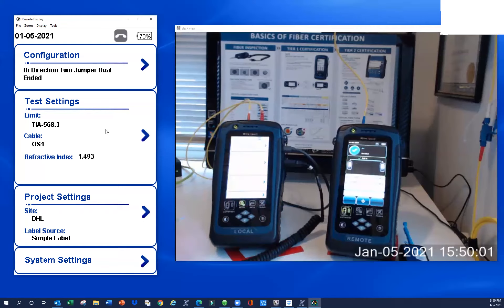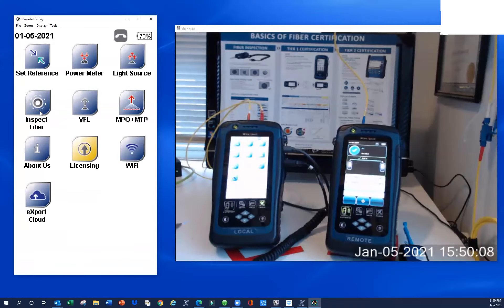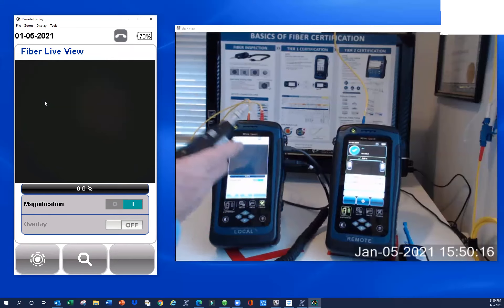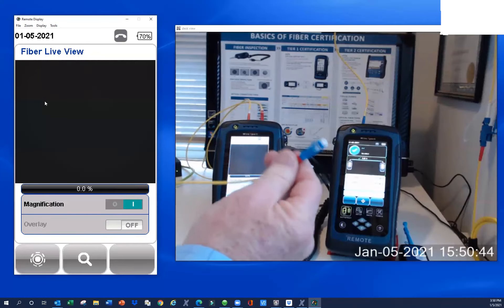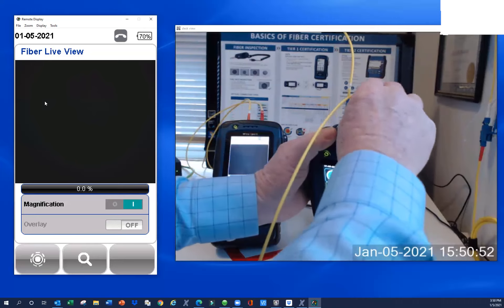Always make sure you're starting with clean end faces. I'm going to go to the Tools section and hit Inspect Fiber. My digital scope is connected and I have the ability to look at end faces right on the screen. I'm going off camera a little bit here because I need to be able to see. There's the end face — the smaller gray area is the core. This is single mode, so it's a nine micron core. This one's pretty clean and ready to go. Once an end face is clean, don't set it down and don't put the dust cap back on — dust caps are dust magnets. Go ahead and put it right into the tester.